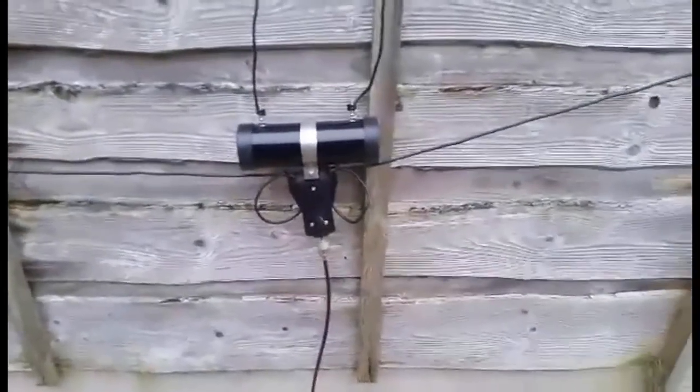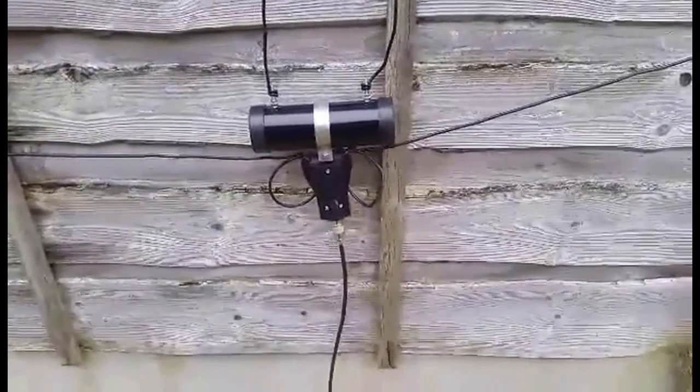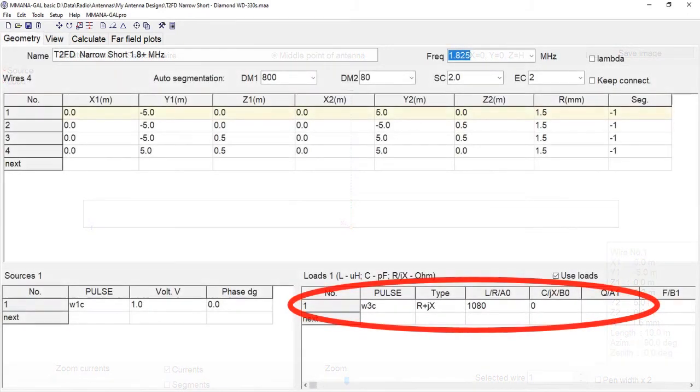The reason for this is I'm actually in a valley, which makes it difficult to get out, so I need as much of the signal to go upwards as possible. The large black cylinder on top of the balun is the actual resistor. In MMANA I made some alterations to match the Diamond design — it's horizontal rather than tilted as the original design, and also 10 meters instead of 25 meters. After measuring the resistor using a multimeter, I discovered it was a 1080 ohm resistor, most likely because of the 10 meter length rather than the full 25 meter.